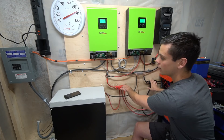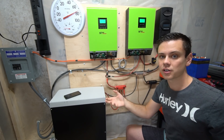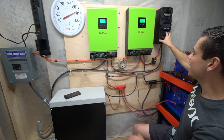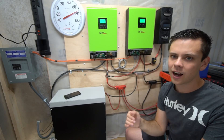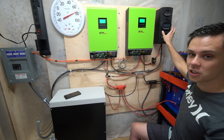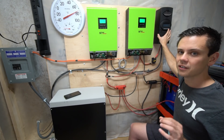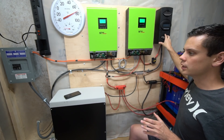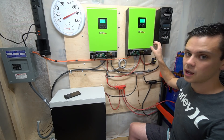All the solar panels on the roof of the solar shed — the 540 watts — actually goes through the Outback Power MPPT over here. One of my viewers said I need to use the higher quality, more expensive stuff, and he was right. This has every UL listing and safety certification under the sun, it has ceramic capacitors so it will last a very long time. This thing is so easy to use — the logging, programming, absorption, and float are amazing. I love the FlexMax by Outback.